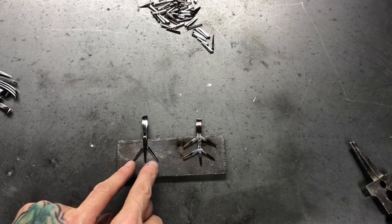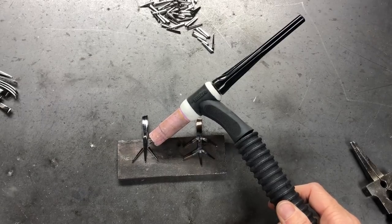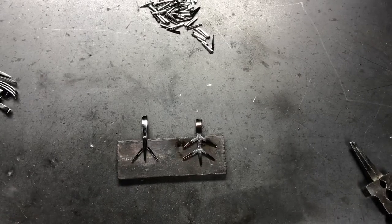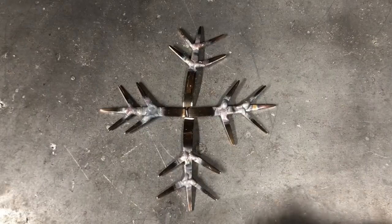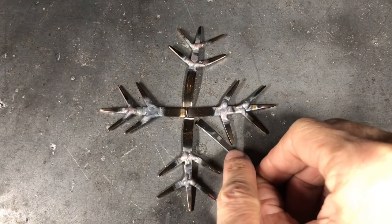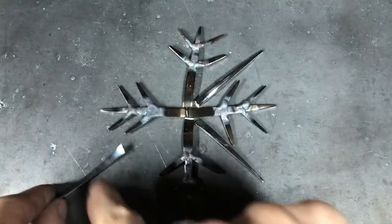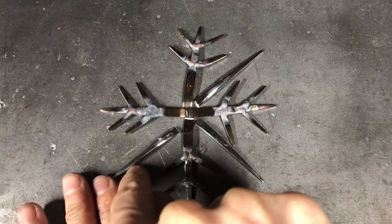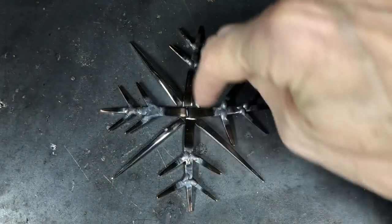Now that we have our pieces cut, we're gonna set the two small tips up to the full tine and use your TIG welder with some filler rod to weld each piece on. I've got one right here — it's super hot but it's already welded, and that's all you've got, just like that. You're gonna make four of these and leave the other four just as they are. Now we lay them all out, with the inside tines — the thinner, more narrow pieces — laid out in between. Once those are laid out, you weld them all together, welding everything to everything else right in the center — I ended up welding a whole circle in the center.